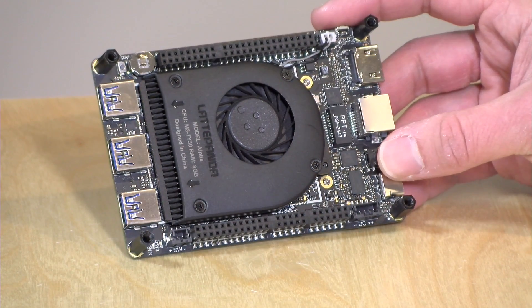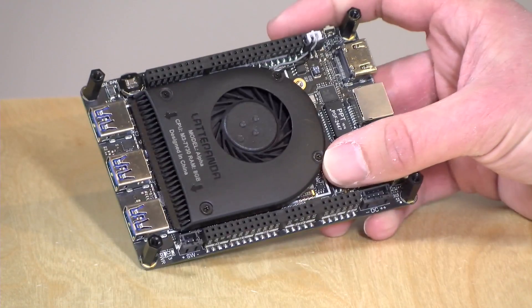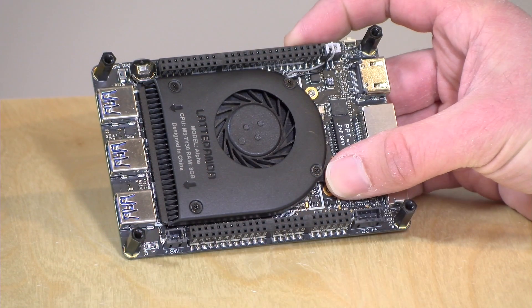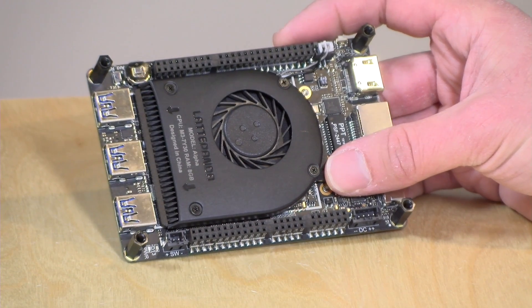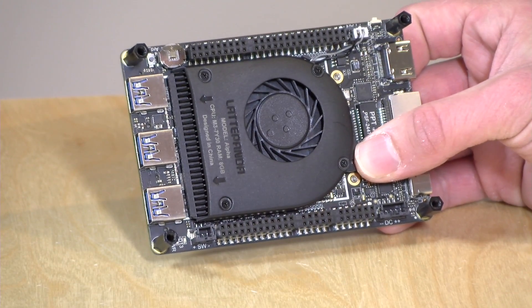I don't want to waste anyone's time, but I will try to find some examples — definitely let me know in the comments below. The one we're looking at today costs $300 for the base model. They do have a configuration with built-in eMMC storage, and unfortunately I didn't get that one — I probably should have. I added a PCIe slot on the back of the Latte Panda, which required me to remove my internal storage, making it a little difficult to get Windows running. You might just want to get the version with eMMC storage so you can boot right off the device itself, and then add things like this PCIe adapter later.